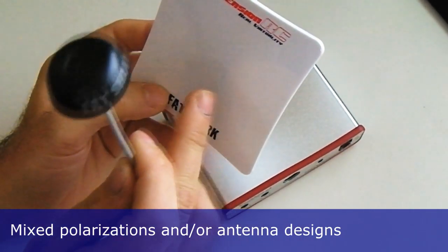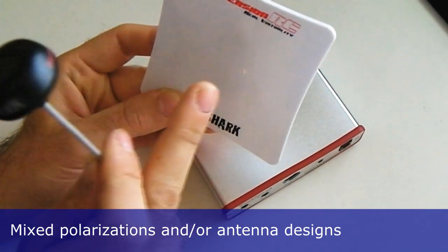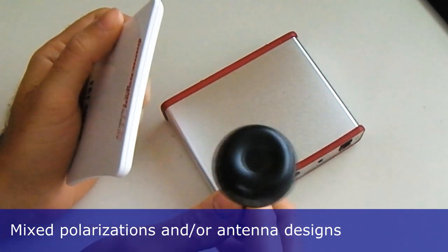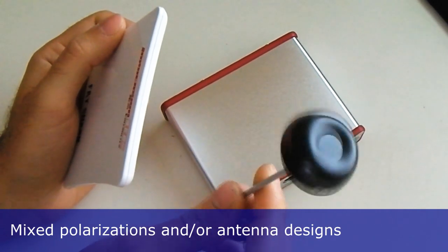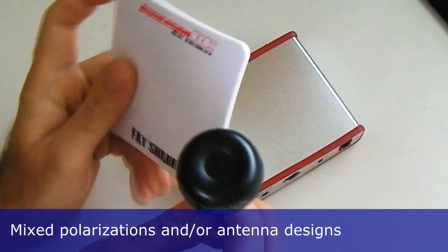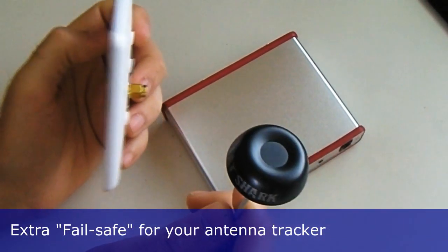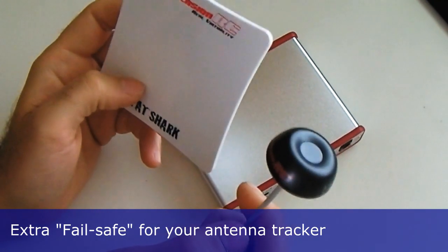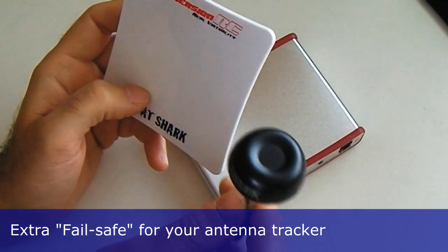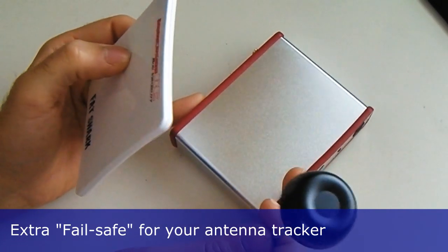As I fly further and further away in front of my patch antenna, the diversity receiver should switch to the patch antenna, and if I fly off course or get closer, it will more than likely switch back to the circular polarized antenna. Furthermore, if you really want to increase your range, you can invest in an antenna tracker. The diversity receivers really lend themselves to antenna trackers.